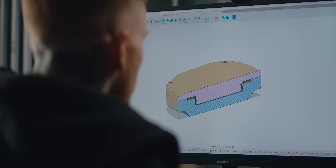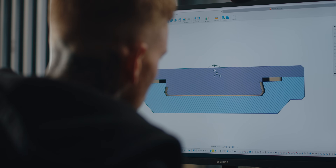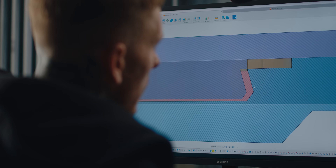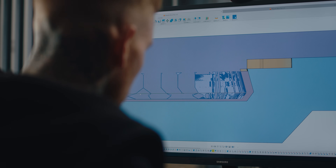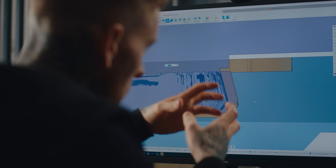As I've been designing the moulds, there are certain things I've had to keep in mind to make sure the moulds are actually going to work. On the pad, you've got internal and external draft angles which will cause the mould to lock together. If we take a look at the cross-section of the mould, we'll be able to see why we're going to have some issues taking these two halves apart. With an empty mould, you can just see enough clearance for these two halves to nest together. But as soon as we cast something into it, you can see that with these two draft angles, we've essentially made two undercuts. If we try and remove the back with the pad attached to it, you can see that we'll end up fouling — it just physically wouldn't move.